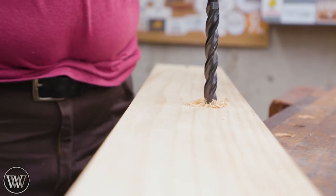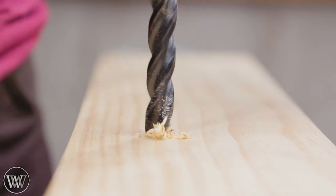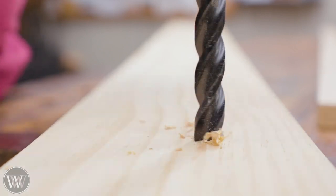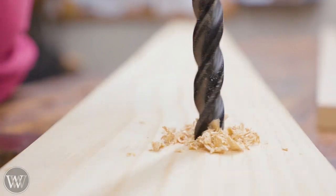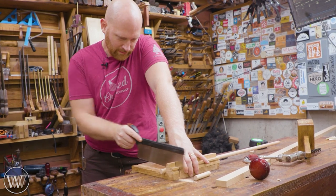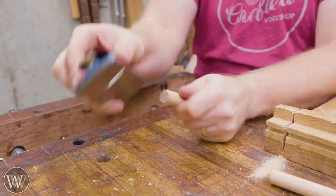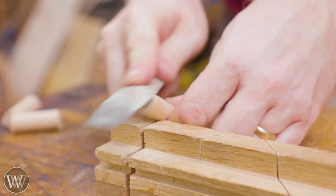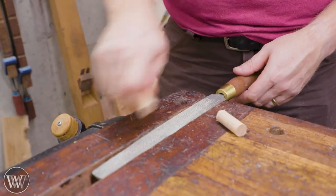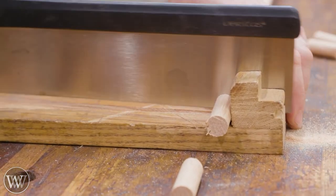First I want to create stops so the board will lock down to the bench. I'll put the board on the bench, put a hole up through it, pound in a spot so I know exactly where it's at, and then drill the holes into the board. I'm going to put in two dowels that locate into the dog holes on my bench. These need to be a little longer because they go through the one inch of pine and then the three inches or so of the bench. I'll chamfer the ends so they go into the dog holes easily. For small ones like these, I find using a rasp is easier than a plane.